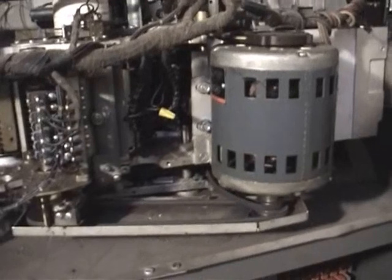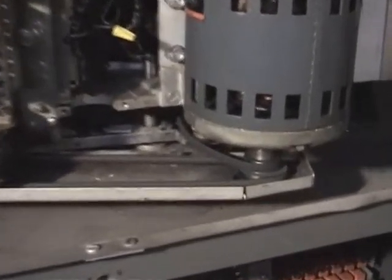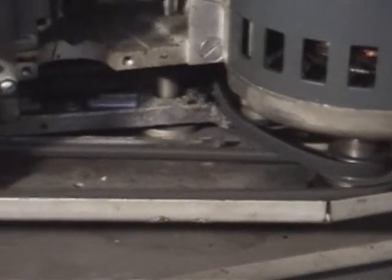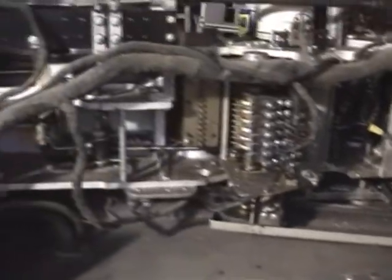As you should be able to hear, the motor is turning. You can see that a couple of the belts here are in pretty bad shape, but they're still fulfilling their function. The mechanical parts of this keypunch work on what's called a clutch cycle — one little trigger clutch cycle — so you can see how everything turns here.